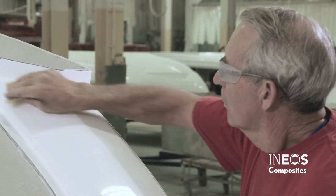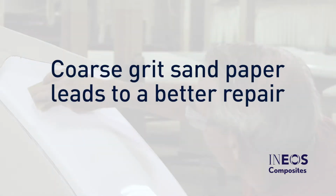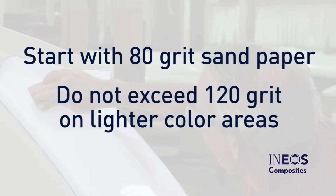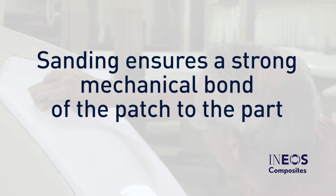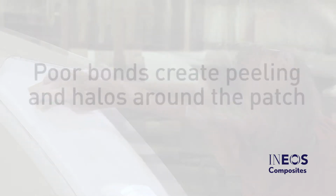Before making a spray patch, sand the area to be sprayed by hand. The coarser grit gives a better repair, particularly with dark colors. 80 grit is a good place to start, with no more than 120 grit for lighter colors. Sanding the area ensures a good mechanical bond of the sprayed patch to the part. A poorly bonded patch will peel when sanded. A poor mechanical bond may also result in a halo around the patch.